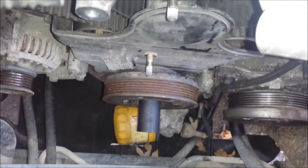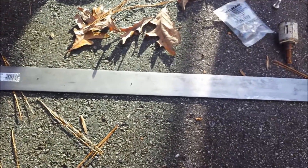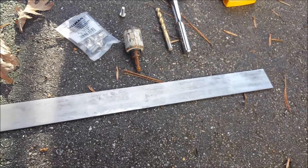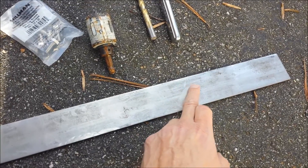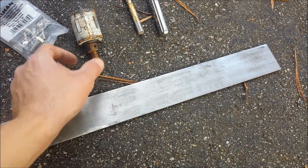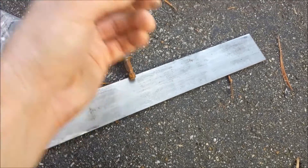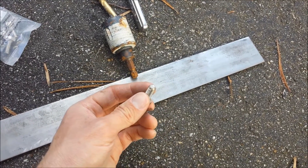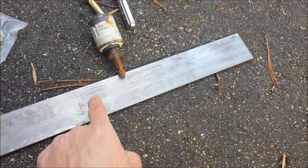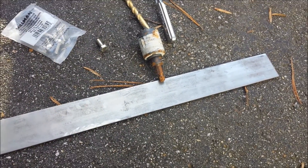So let me show you what I've got here. I've got a piece of flat stock, 2 inches wide and 2 feet long. I'm going to have to cut maybe 4 or 5 inches off the end — I think I only need about 19 or 20 inches. Then we're going to put a hole for the socket to fit through. I believe this is an inch and 7/8 hole saw that we'll use to drill through. And then I've got some M8 by 1.25 stainless steel machine screws. I'll need to put a hole on either side of the socket hole for these to thread into the pulley and hold the flat stock tight so it can bear on the frame.